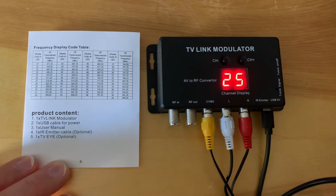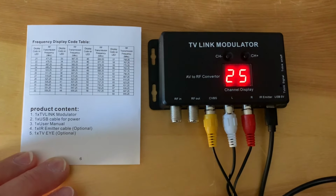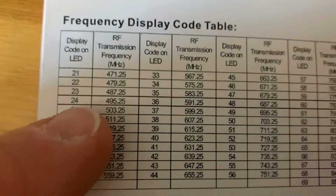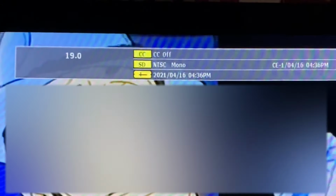One thing you should know is that the display you see here, 25, does not correspond to the actual channel you'll be modulating on. That number actually corresponds to a frequency in this chart here. 25 corresponds to 503 megahertz, which is actually channel 19 in TV frequencies. And that's the channel that came up when I ran my channel scan.